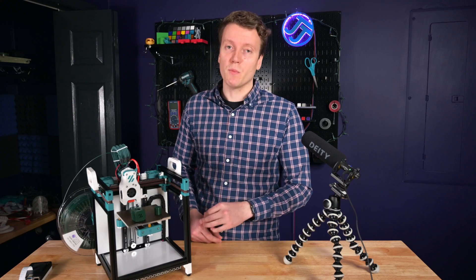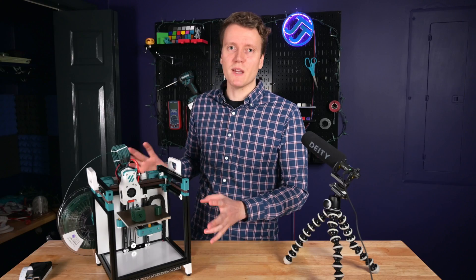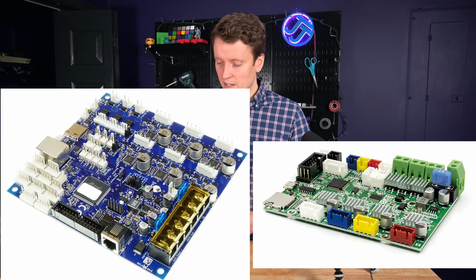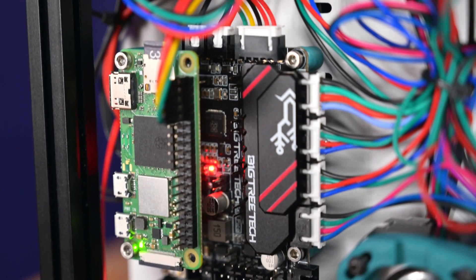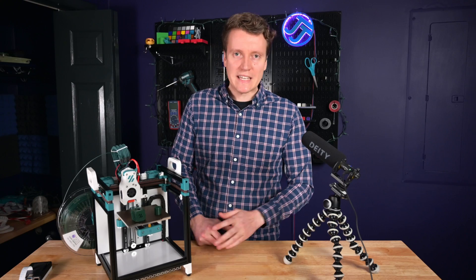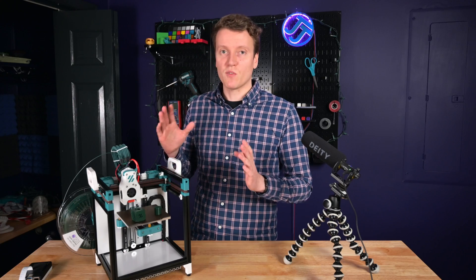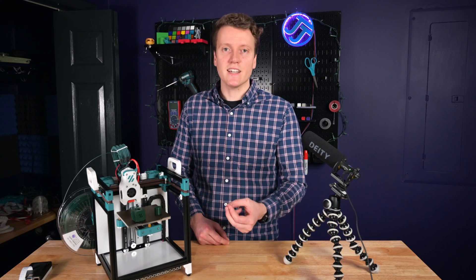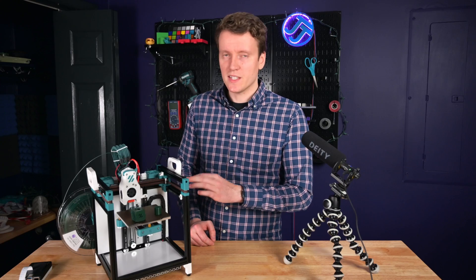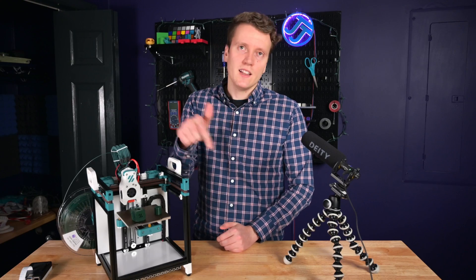The second big difference of this main board is the aesthetics. It looks way more like a computer's motherboard than a 3D printer main board. Usually these main boards are more function over form — they're just trying to pack a bunch of features on there. With this one, they put a nice big heat sink on there that really makes it look great. They also put all the plugs on the side, which makes wiring it up actually pretty easy. It's nice to see that the aesthetic changes were also functional changes. The plugs being on the side makes it really low profile and easy to work with, and the big heat sink helps cool down your stepper motor drivers. I'll be trying to run some tests in the future to see just how good that heat sink is — let me know in the comments if you have any specific questions about tests I should run.